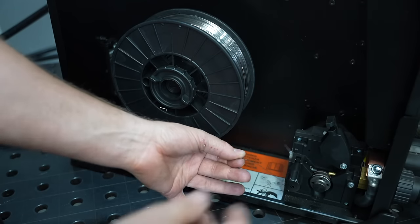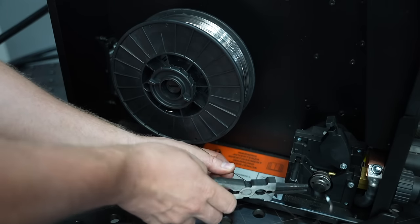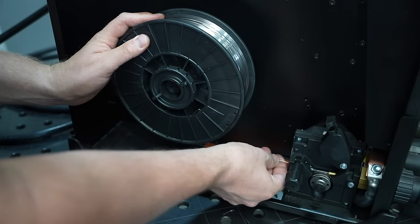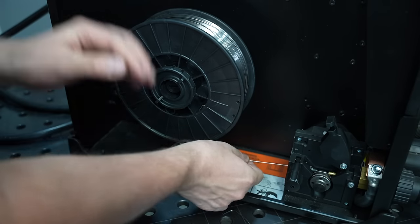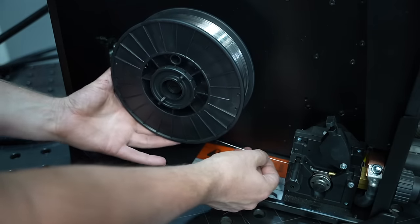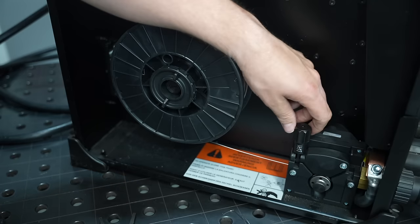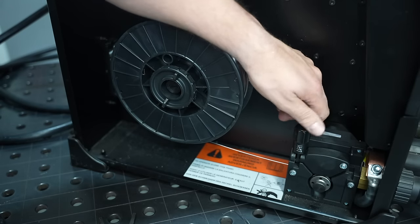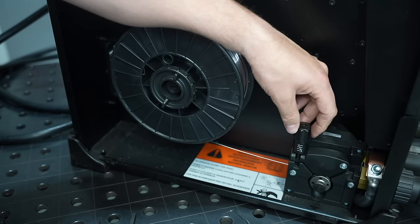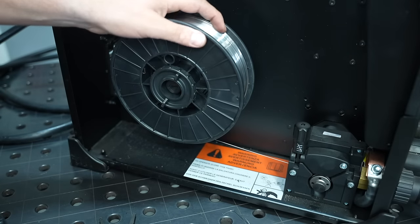With the right drive roll installed, I can feed my wire in. Rather than trying to straighten the wire out, I'll just clip the end off right here so I have a nice smooth start to feed into the guide and ultimately into the gun liner. Since the gun is already installed on this machine, I'll just feed it right through — that usually goes fine, but if it gets jammed you might need to remove the gun. I'm also going to loosen this idler — it's way too tight, which is almost always the case on machines I haven't been welding on. I'll loosen it way up and dial it in once the wire is fed down through the gun.